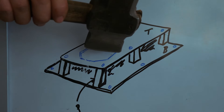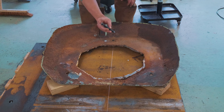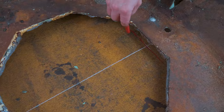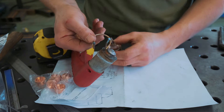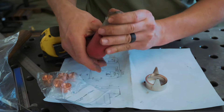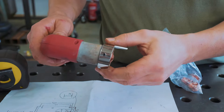Next step, we need to cut out this big hole for the anvil to poke through. I ran out of pen — I'm in chalk. I think lipstick's going to be my new metal marking medium. This is working amazingly. Before we get to cutting, we should probably do something about this nasty torch. We're going to replace these bits of wire with this thing — looks a little more meaty. And we should probably change tips. Okay, we'll shove a new tip in and see how this works.